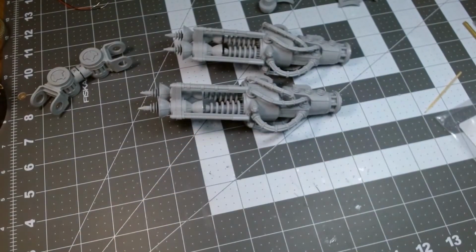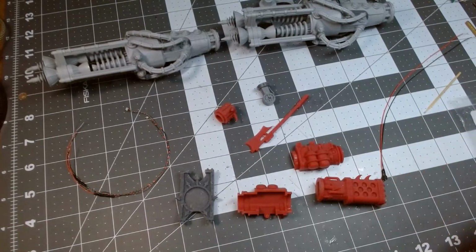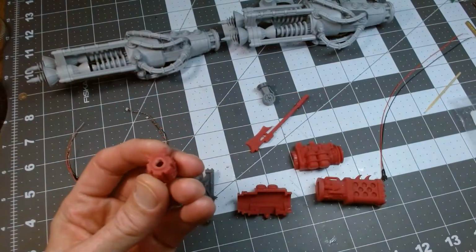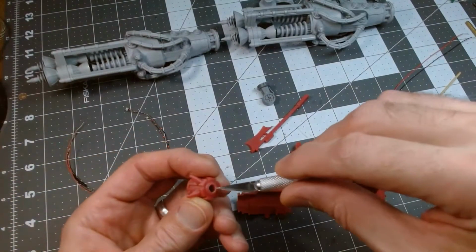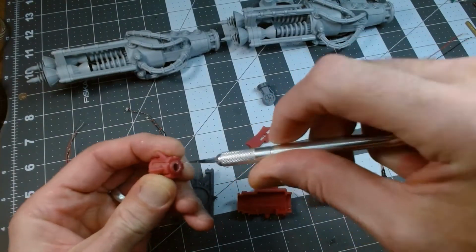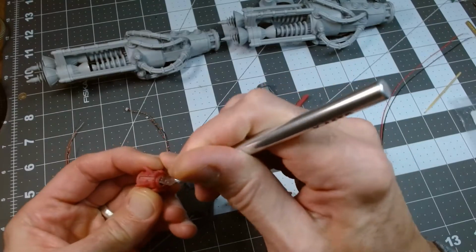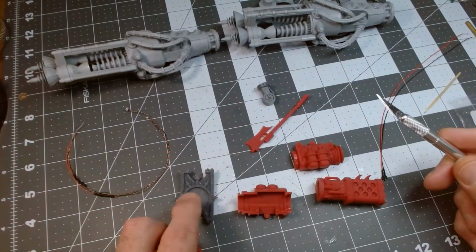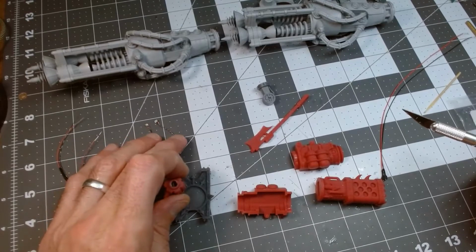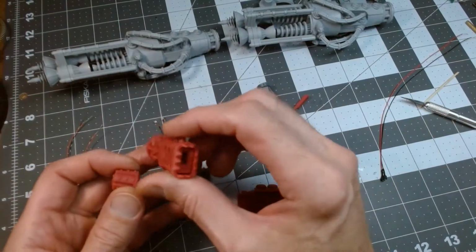Alright, so these are the elements for the thermal cannon kit from Watcorp. So all I have is essentially just pretty much started hollowing out the base to make room here for the power cord, or the plug, I guess. So this should be a pretty straightforward build. I'm going to drill a little hole through here, and then the two red chip LEDs from Evan Designs will get mounted to this so that they project through here.